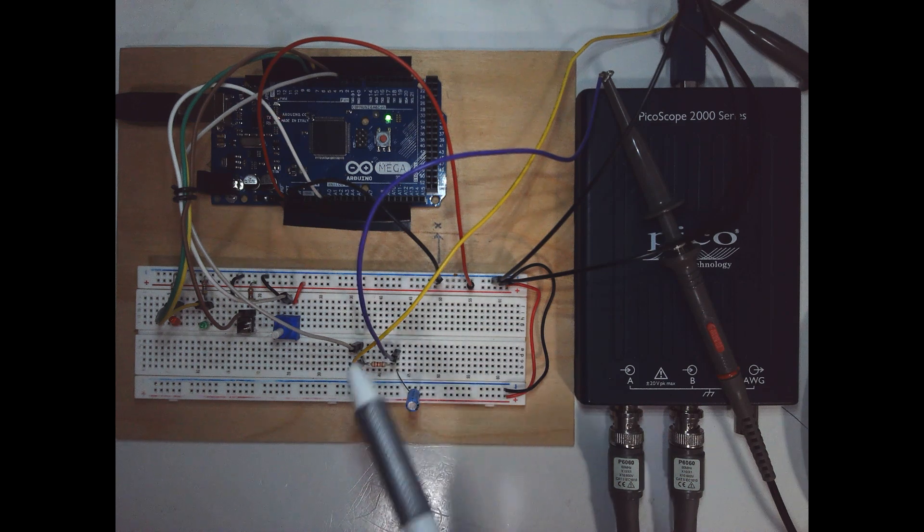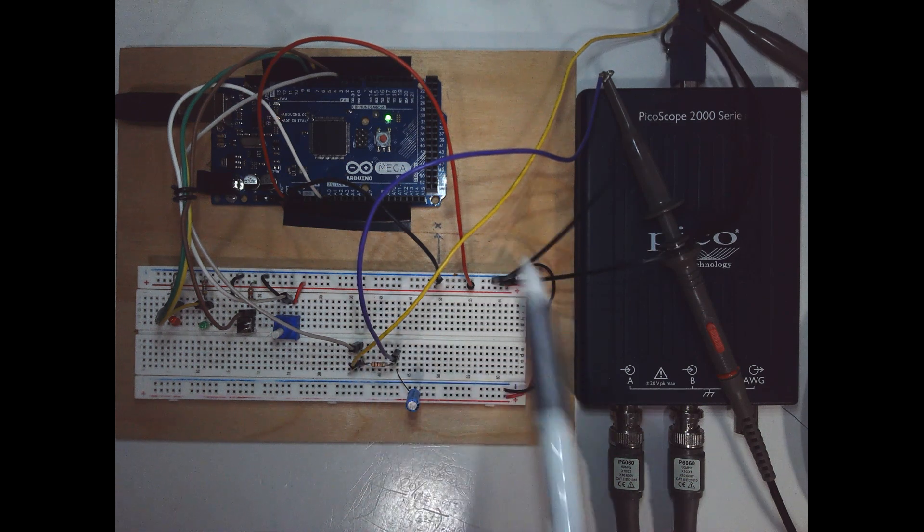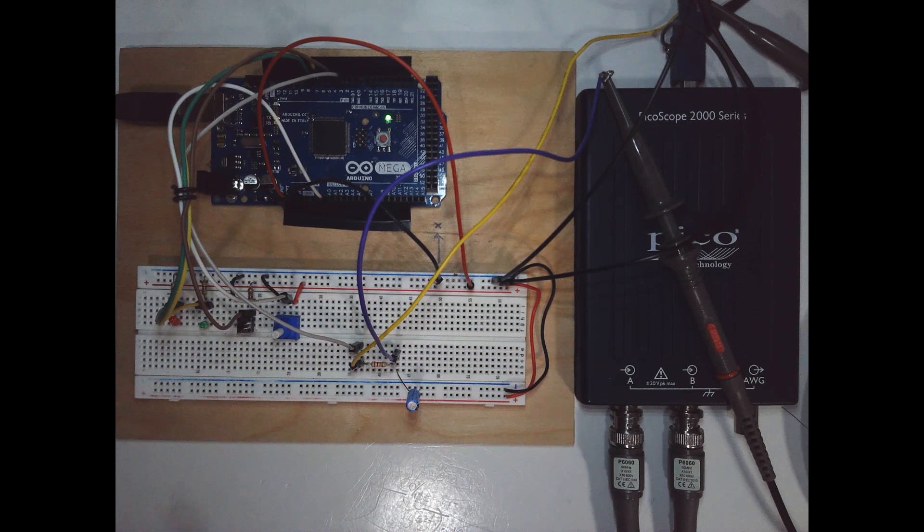This yellow and violet wire and these two are ground connections to the oscilloscope. Back over here at the low-pass filter, this is a polarized capacitor, so make sure the negative side is going to ground and the positive side to our circuit. We have two channels on the oscilloscope measuring the pulse width modulated signal at this point and the filtered DC signal at this point.